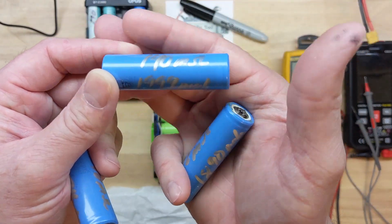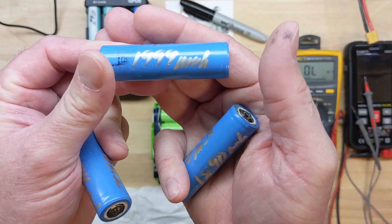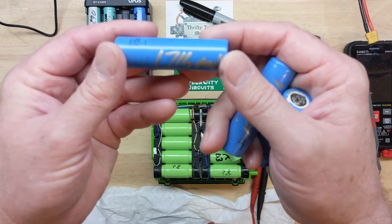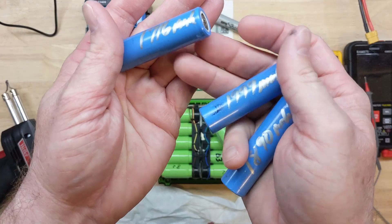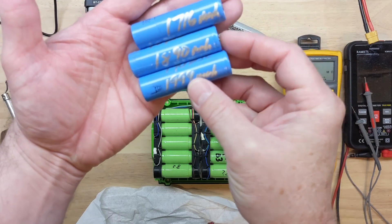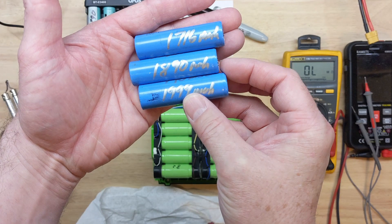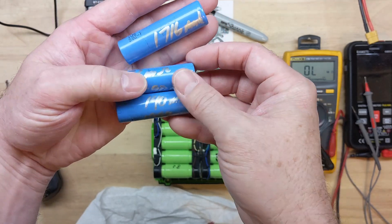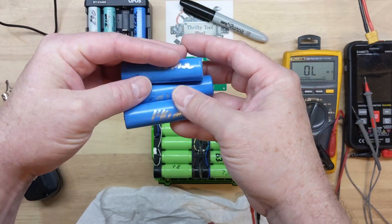These three cells all came from the same DeWalt battery pack, and I picked these three to show that you can't just go by internal resistance alone, and you can't go by milliamp hour capacity rating alone — because my lowest reading in milliohms is also my lowest in milliamp hours. We kind of want the opposite: a new cell should be at or over its rated capacity. These particular Samsung 18650s should be around 30 milliohms brand new per spec. Whether our tester can achieve that accuracy at the connection points is not likely, but we just want a good estimate of how bad the internal resistance is.